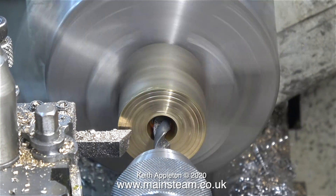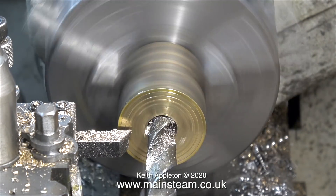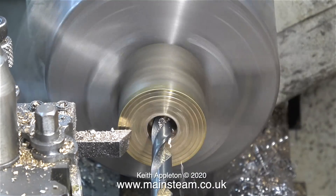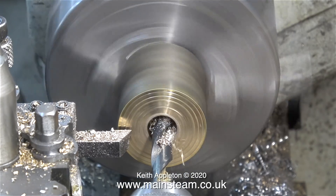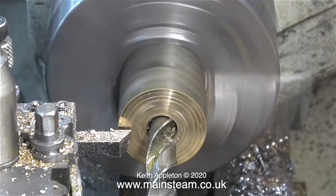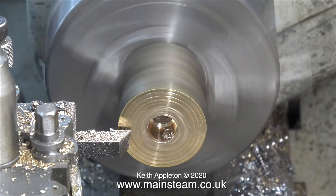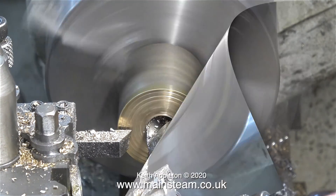Finally, using the smaller drill, it goes all the way through. Once again, when I fit the larger one it just spins round in the tailstock quill — the smaller drill bit was in the tailstock chuck, this one is directly into the quill. To get through this piece of metal successfully I had to go back and use a slightly larger twist drill, but even after applying more oil it still spun round in the tailstock. Note to self: I do need to relap this tailstock quill, but that's not the real problem — it's the metal. It really grabs drills; it's horrible stuff to machine.